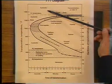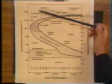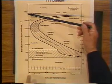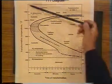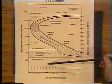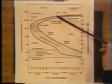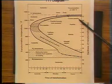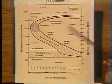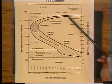A big problem is: can you quench the whole piece of material at one time? You can't — the outside quenches first. So we'll use a very thin little piece of material so when we quench it, it all gets quenched at once. Instead of quenching in water, we'll quench in molten tin, which has a boiling point of about 4100 degrees Fahrenheit. Bain and Davenport found that quenching rapidly yields martensite; holding longer produces coarse pearlite; and intermediate holding times give a mixture of martensite and pearlite.